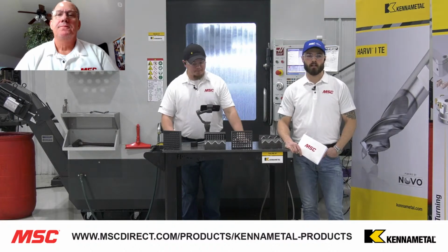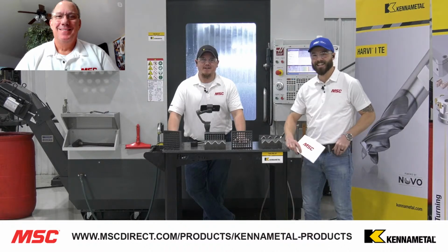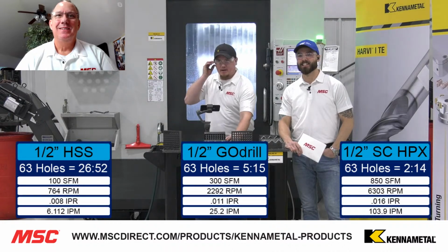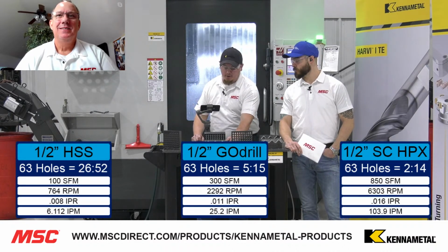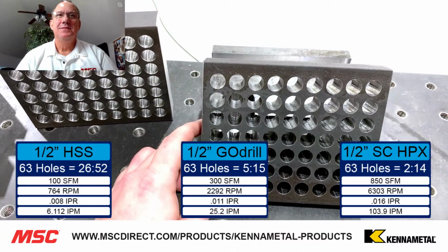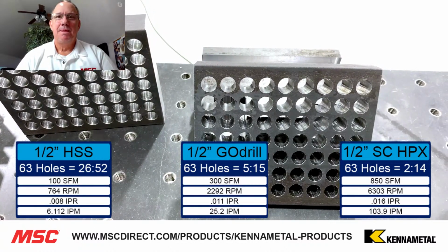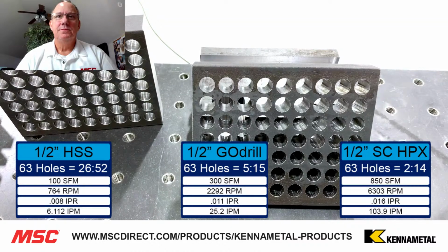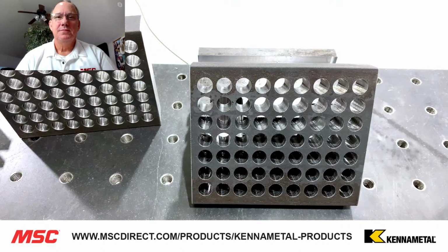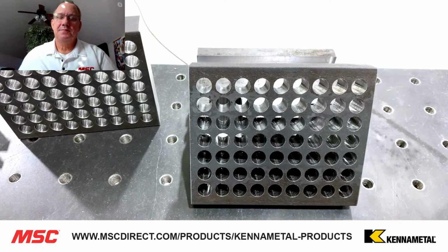Very solid. So with that, are we done with that drill already? Absolutely, yeah. I told you it was going to run quick. Tony did a good job getting everything out there while it was running. But Isaac, if you want to cut to the phone here, I've got the finished quality of the hole, speaking to that tolerance question. I was able to take a 1/2-inch gauge pin and slide it right through these holes. Hardly any play whatsoever. The 501 pin actually did not go in. So this particular drill was able to hold a pretty good tolerance.